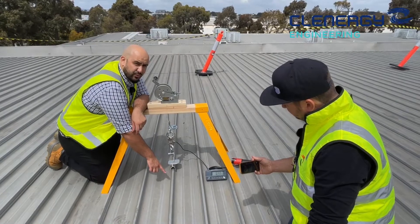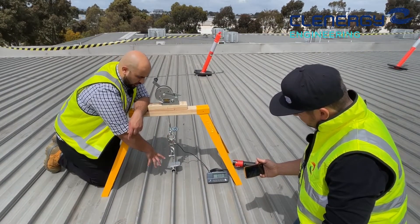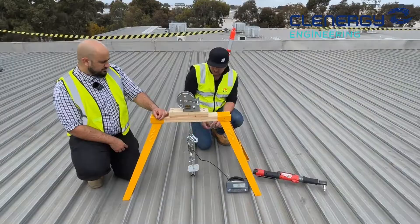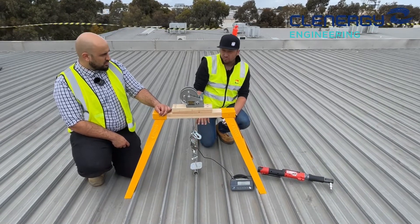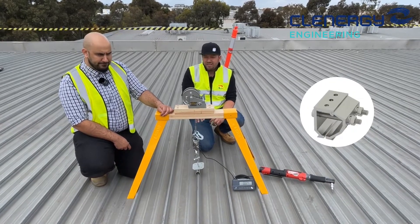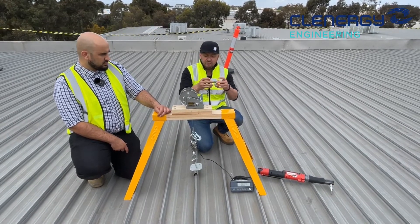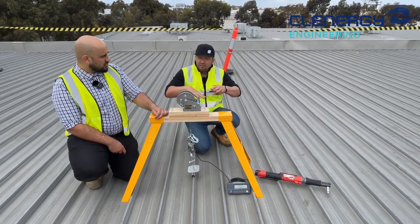The clamp has disengaged from the roof sheet. Note that we put the clamp at the correct torque required — about 18 newton-metres — so we know the clamp is connected correctly, but it still disengaged because the roof sheet deformed as we pulled up, making the clamp slip away. We got to about 1.6 on the full rib for the first test. What this tells us is that even though this clamp fits perfectly on the roofing sheet, it might not give us the best capacity on this roof because the rib is not wide enough. So we're going to try the universal clip lock bracket, the eri34, which has the capability of actually hugging the roofing sheet completely so the failure point will be underneath the roofing sheet rather than on top of it.